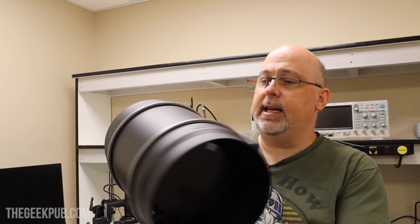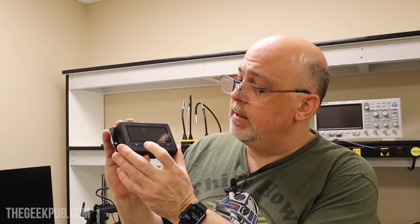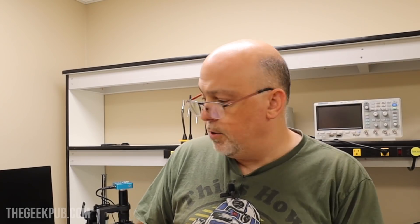We're going to use this — basically a big fan from a company called AC Infinity. We're not sponsored by them; I paid for it with my own money. It will go up in the attic, just above the raised ceiling. It has a temperature controller that sits on the wall — you set it to a certain temperature, and anytime the temperature rises above that threshold it turns the fan on and starts exhausting air. We'll exhaust that into the return vents on the air conditioning unit, which will raise the building temperature just a hair but keep heat out of the server room. Then the regular AC system can bring the temperature back down, so we don't need a dedicated unit for the server room.